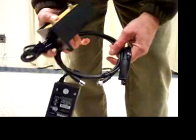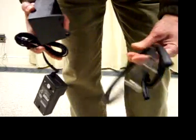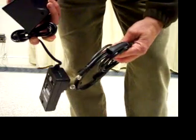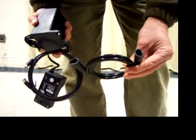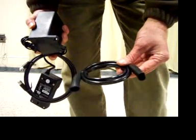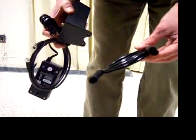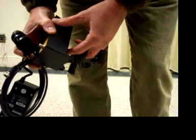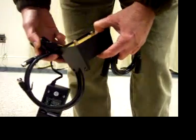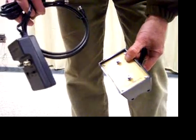It comes with a couple of cables, one about 6 foot cable to go from the power supply to the TV, and a short about a 4 foot cable with some boots on it to attach from a balun, which is included, to the preamp. You would need to supply the length of wire between the preamp and the power supply.